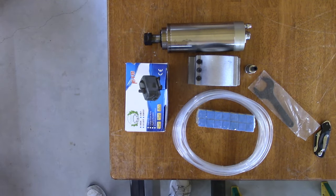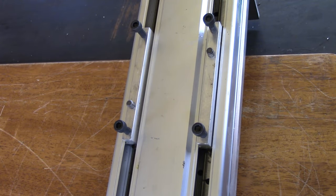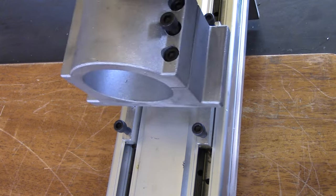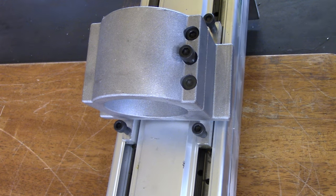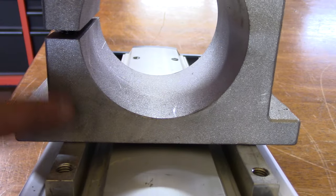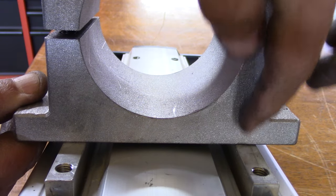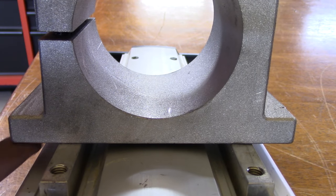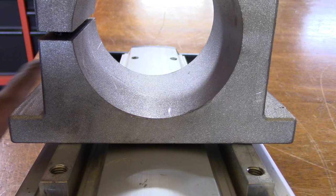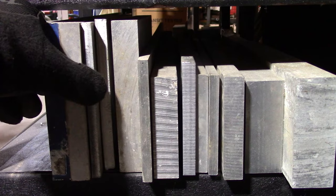Here we're getting all the pieces together — it's just basically the spindle, the bracket, and some parts. I wanted to see what kind of constraints we were going to face when placing the bracket on top of the existing Z-axis mounting points. And of course, you can see this is not going to fly in any way or fashion. The existing Z-axis aluminum tabs will collide with the bracket body, and the bracket sides where you would put the screws are literally flying up in mid-air. So this tells me we will need an intermediary plate to go in between both parts.